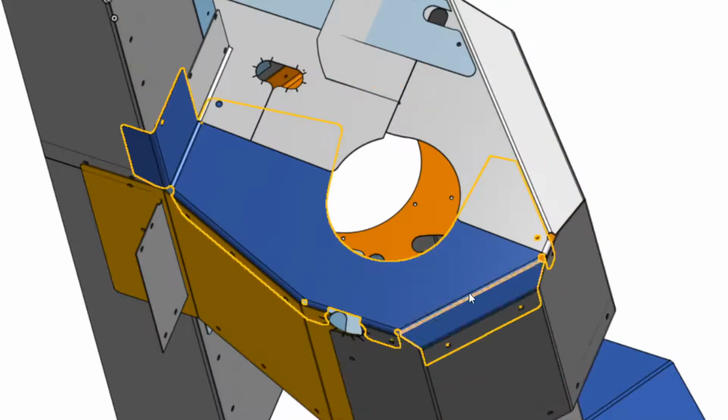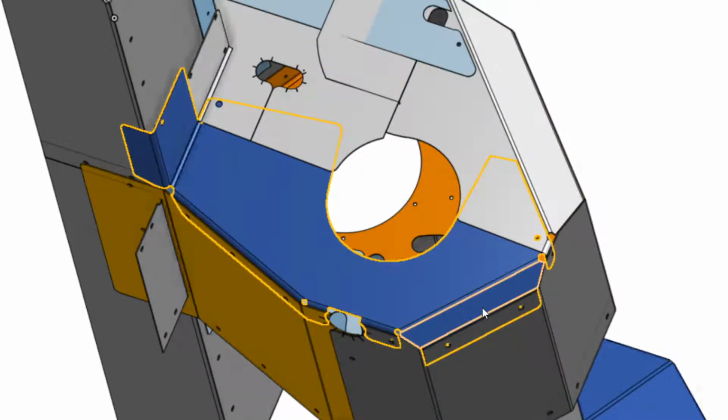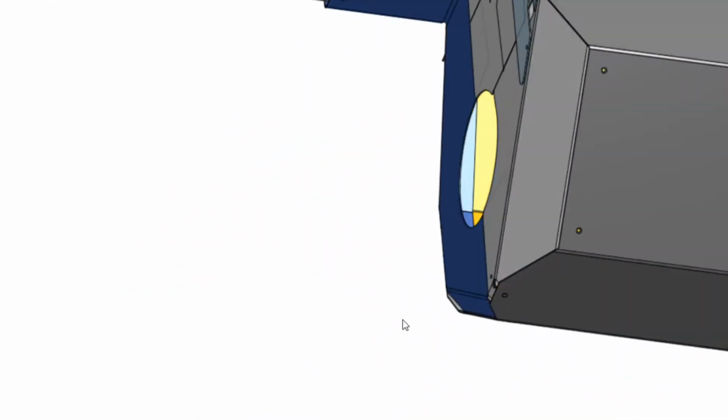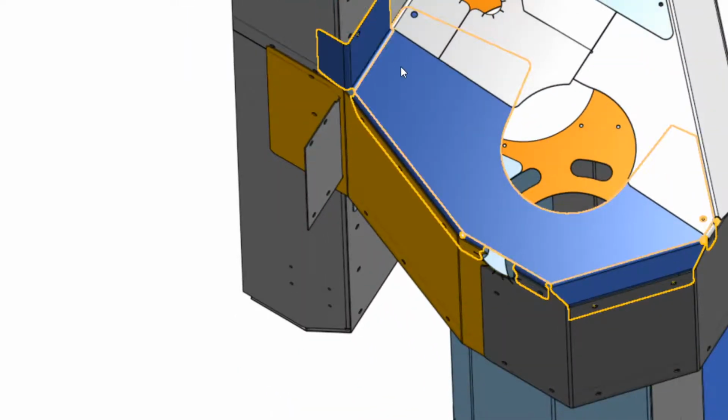The one on here has a 45-degree bend and then another 45-degree bend to get it to a total of 90. Again, there's some aspect, I forget what it is here, that requires that. There's a clearance issue here, and so I had to have that bent 45 to kind of slip out from under that and get over around the outside of the exhaust turbine here. So hopefully that will fit all right. That piece will slide up in place.